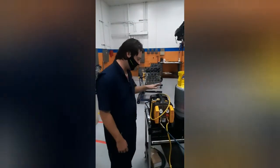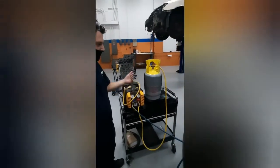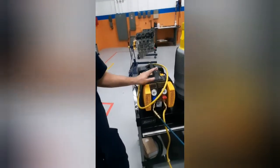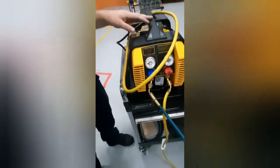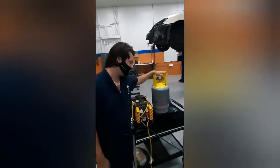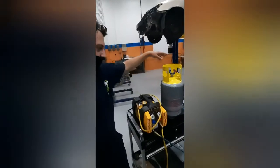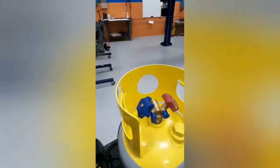The next step you're going to want to do is go ahead and turn this on and pull the vacuum and suck all the refrigerant out. Once you've done this it'll light up or buzz depending on the unit you have. Once you're done with that you can go ahead and finish off by closing off these valves here. When you're working with the valves, make sure you read the tops because they're not color coded — they come differently depending on which tank you get.